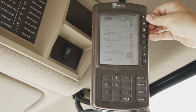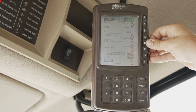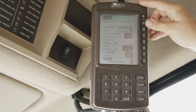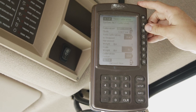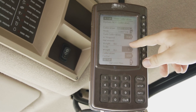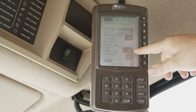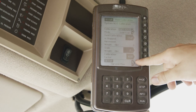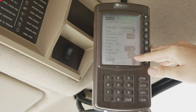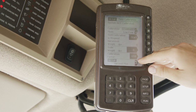Harvest monitor allows you to select your farm, field and crop type, your header type and yield calibration. Getting into our yield calibration, we can calibrate standard or low flow. We will be able to view when our yield calibration has started or stopped and how much weight we have accumulated. We can put in our scale weight for how much was radioed back from the elevator and then our calibration factor. When you have completed a yield calibration, this calibration factor will change automatically based on the system's parameters.